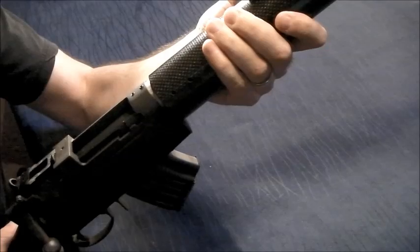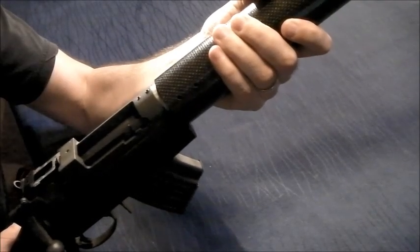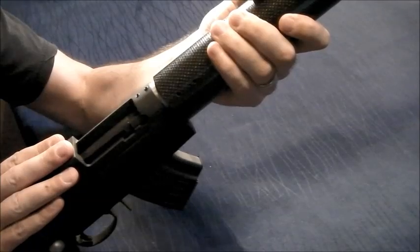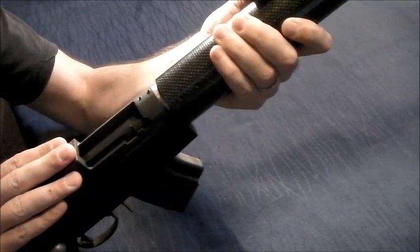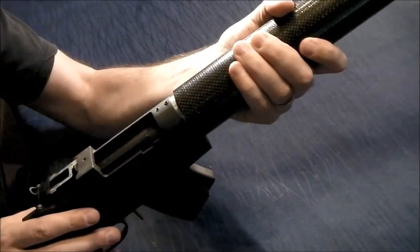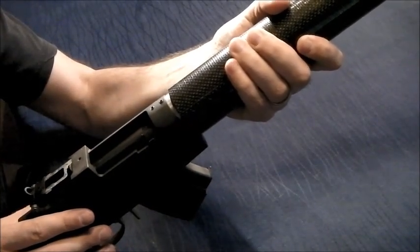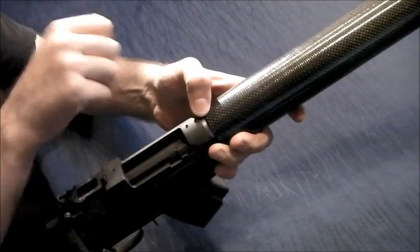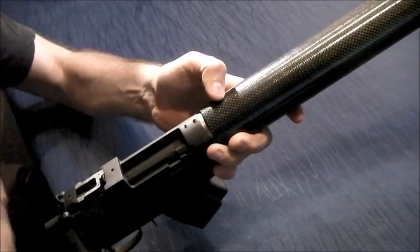Unfortunately, of the two my tame gun plumber had his hands on, he had this one and he had another one that he converted to 6.5 Grendel. The nuts were not done up very tight, and he showed me with great glee when he took the original barrel off this one. He just put a little drift on the nut and tapped it gently with a little jeweler's hammer and it just went ding and was off.